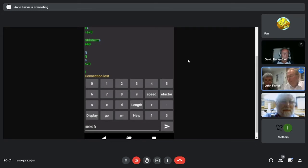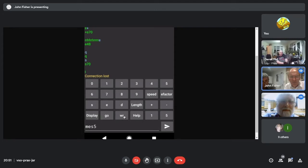So yes, they won't have to keep notes in their notebook as to what they've set it to, because they'll press the WR button on the Bluetooth, and it will be written to the params.py file, which, when they get it back into Thonny and switch on the view mode file, they can actually read the parameters back on screen through Thonny. It's rather cool.